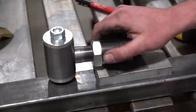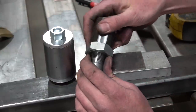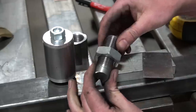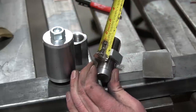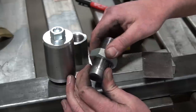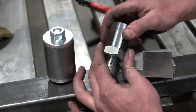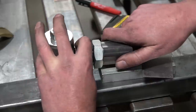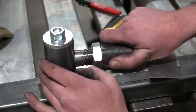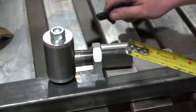Adjustability is definitely something I want to incorporate because the original Cadillac system used these funny-looking four-bolt shims that you can't even get anymore. We can completely eliminate them and standardize everything. This gigantic inch-and-an-eighth pin is what we're going to use for adjustment. I measure out the usable threads - it comes out to about an inch - so I want the jam nut basically up against the housing at exactly one inch, giving us the same amount of inward and outward movement while maintaining strength at factory length.